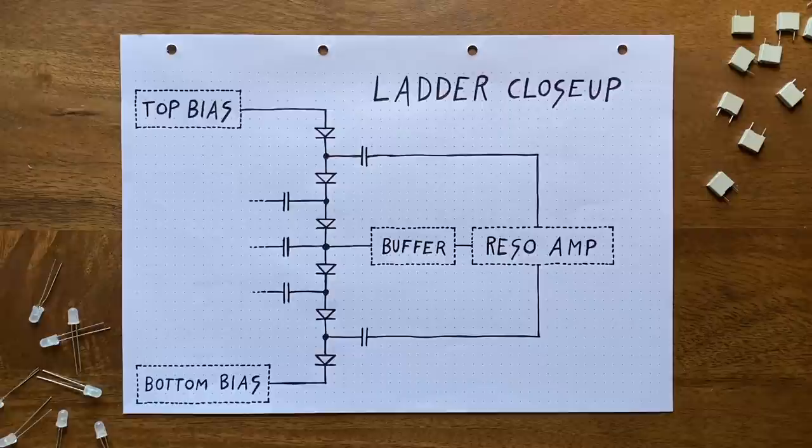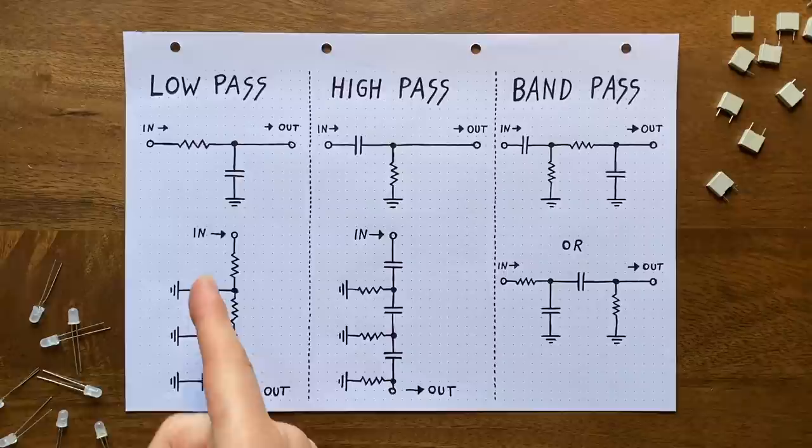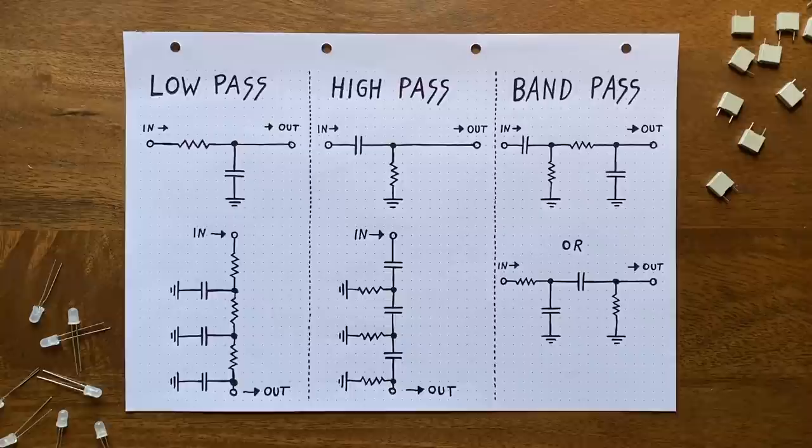And so our diodes will pretty much block as well. So what's the other option? Simple, we ground this point and then apply our input signal to the last filtering capacitor. This way, that capacitor, in conjunction with these resistances to ground, forms something like a simple single-stage high-pass filter.